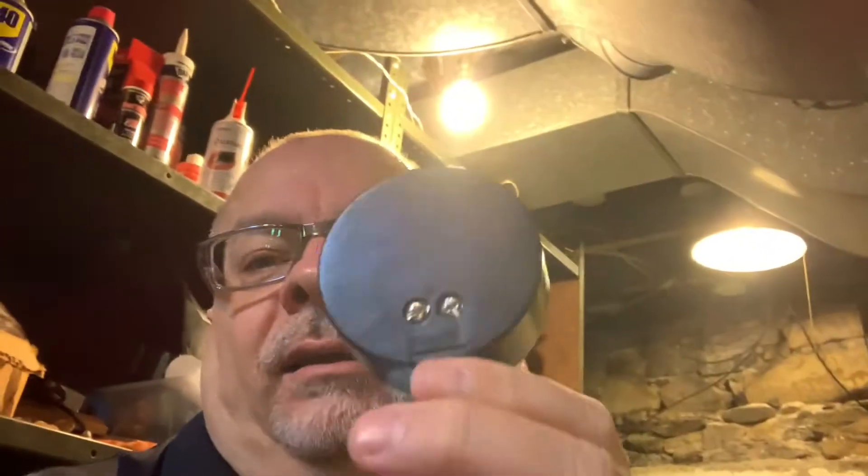Now, how do you keep the water tank from having too much pressure in the first place? Easy — you use a water pressure gauge. I have one right here. I've actually made a video on how to use the water pressure gauge on your house to make sure that your water pressure is between about 40 and 60 pounds per square inch. It's really easy to do. I'll have a link to that video and blog in the description below.